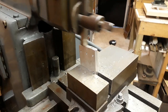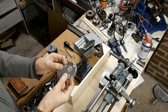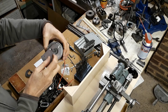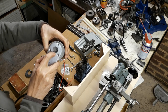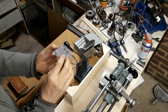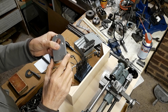After removal from the vise it was necessary just to touch up the corners with a file to remove any burrs. So here's the motor mounting plate almost complete. It will be mounted like that — this provides access for the boss on the smaller pulley. Here's the access hole for the set screw in the pulley. It's complete apart from tapping these holes, and the reason for that is I'm going to use this as a template for drilling out the holes in the frame.